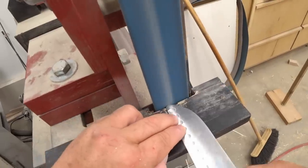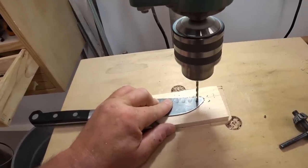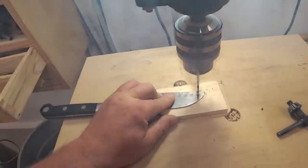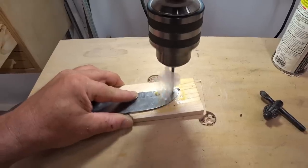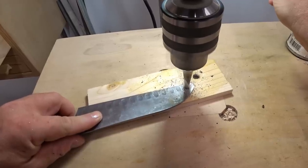This doesn't have to be super sharp, not for cutting cheese anyway. Now to make the knife pivot I have to drill a hole through it, and this is hardened stainless steel so it's very difficult to drill. As you can see I've already ruined one bit, but for the prototype the hole doesn't need to be fancy — I just need to get a screw in there so that it will lever up and down.